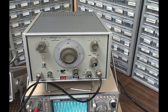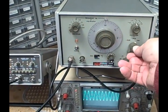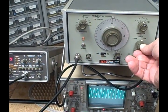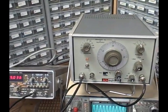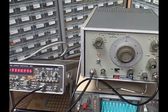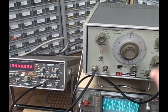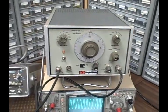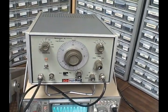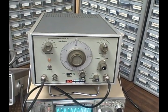There's a fine control that allows you to infinitely change the setting in between. So if you want 5 volts, you go to the 10 volt range at 0 dB and then adjust your fine control for half. The amplitude controls are accurate to within plus or minus 0.2 dB.